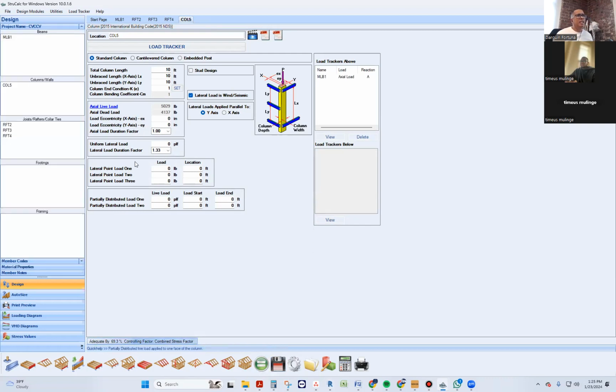Good. Then that one's gonna need another header because that's what you're doing. You know how to do that. That header is only gonna have a point load. Don't worry about the rest. And then you're gonna have to size 2 other posts that will likely have to be 5.25 by 5.25 each side. So you could probably use studs too. By the way, you could use like 3 2x4s together, 3 2x6 together. But that's something you have to test. Now that's it. That's it.